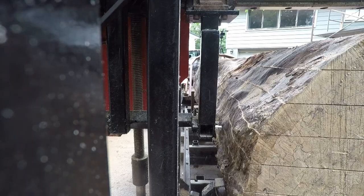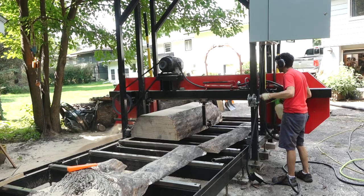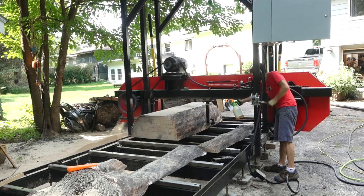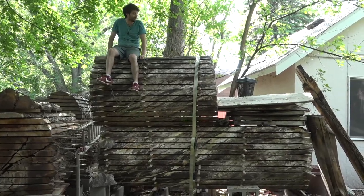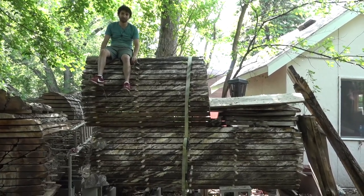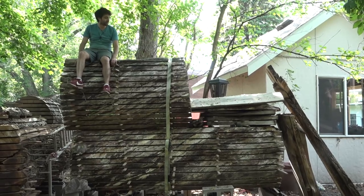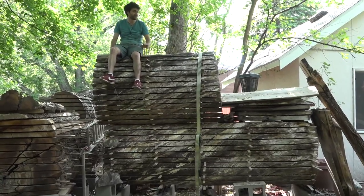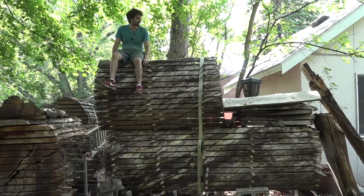The smaller log on top had a lot of really interesting figure and colors and is much more manageable because they're not super big. These have been sitting out here drying for about 10 months and I've utilized the smaller log as a weight to help keep the bottom stack flat. Silver maple dries a lot more quickly than some other species — at about two and a half inches thick, it's currently reading about 12% on the moisture meter, so it's getting close to outdoor equilibrium. Pretty soon it can go in for a final drying to bring it below 10% and be ready for use.